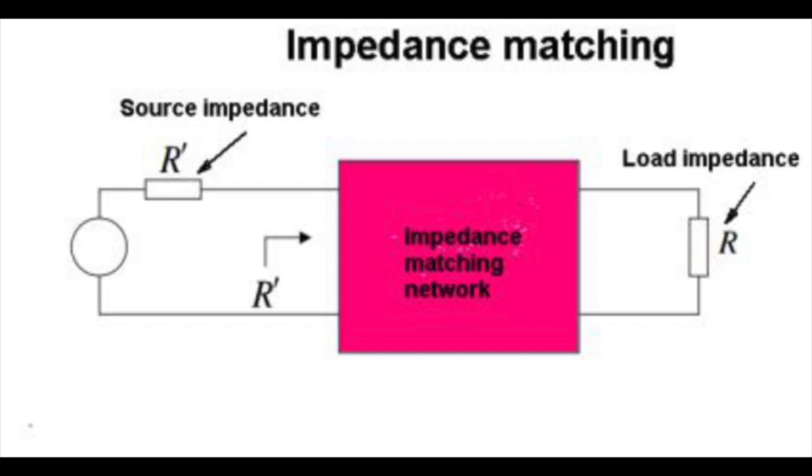The most important one is the impedance matching. We are talking about impedance matching at both the antenna, and how to match the impedance of the antenna to your LC circuit's coil, and also the impedance matching at the output end, how you match your detector's output impedance with your headphone. So both need to be taken care of.